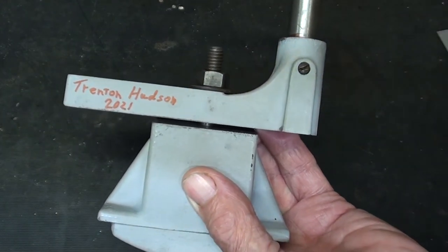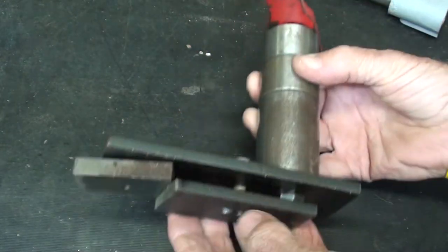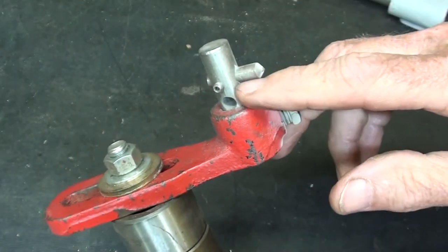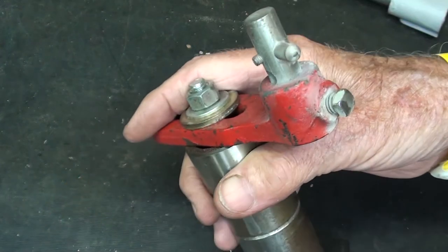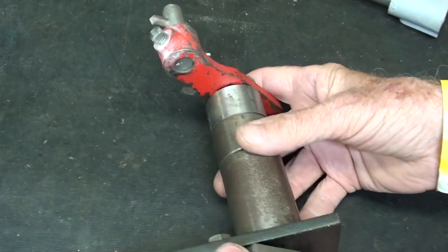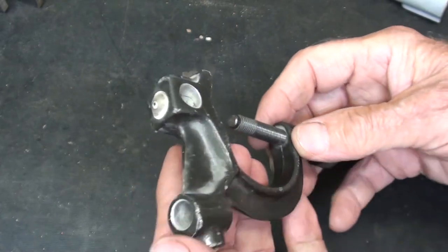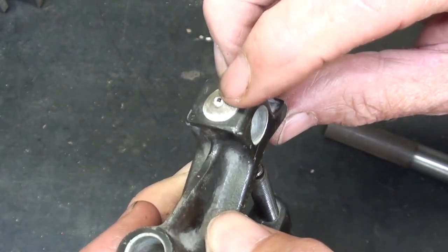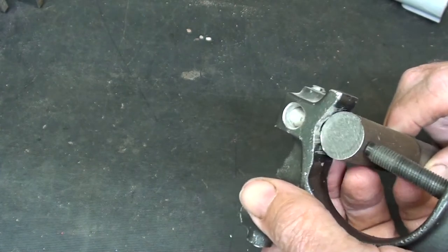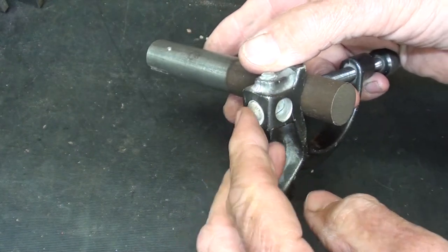You can tell I've got shapers on my mind. You've probably seen me use this other homemade dresser — I might have used it on the Logan or various lathes. There you can see a diamond nib very similar to what I just showed you, and these are some milling machine spacers that gave me the right height. This is a genuine Dumor dresser, and the diamond nib can be set in this hole or this hole. It has a bit of a V-way, so when you set your work up in the lathe, you could clamp that to the work and then run the wheel across the diamond nib.